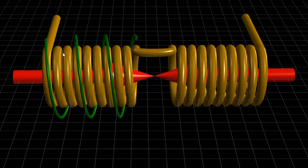The closest coupled coil will see this action and then create a reaction. The output coil creates a voltage, and if we have a load across the terminals of the coil, a current will flow, and we have an opposite reaction. This reaction can have a counter reaction.